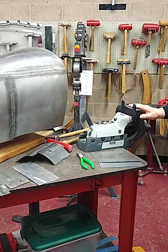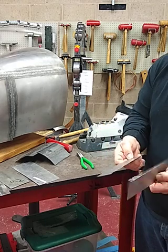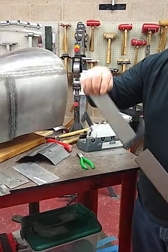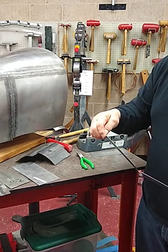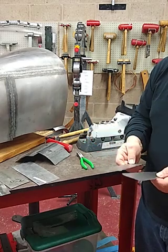The lipping tool allows us to make that process work a little quicker. What we do in essence is put these lips in at a very slight angle on both of our jointed panels, instead of traditional fusion welding where we would try to join thin gauge sheet metal directly — which is a pretty daunting task.